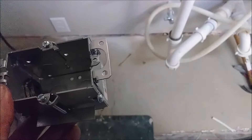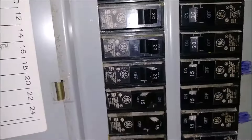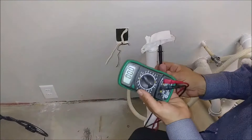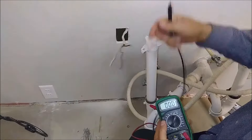The cable will come from here, go inside, and we'll connect it to the outlet. Here's the cable — there is no voltage or power on it. I already disconnected the power, but just to make sure I have a voltmeter here. I check the power between the ground — the power should be 120V if there is power. There is not 120 here, so I can touch it. No problem whatsoever.